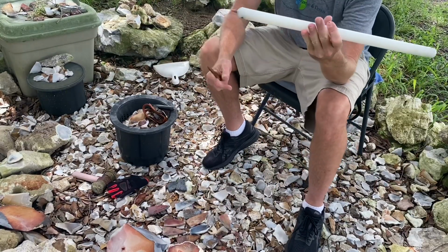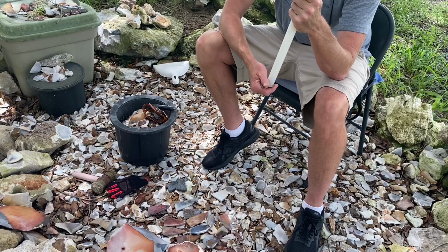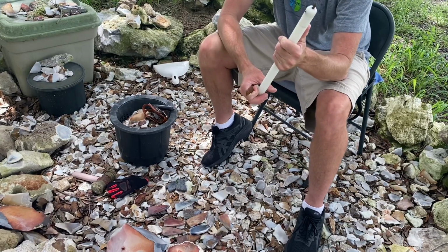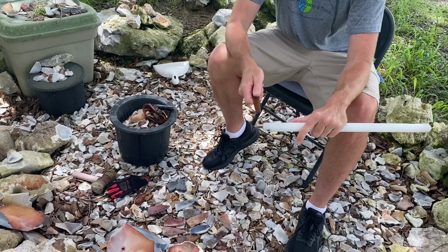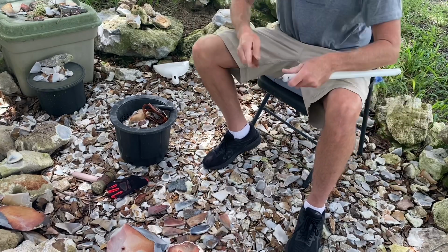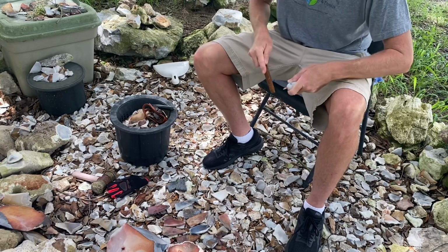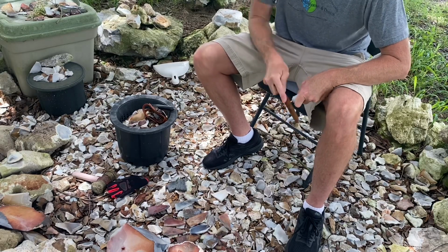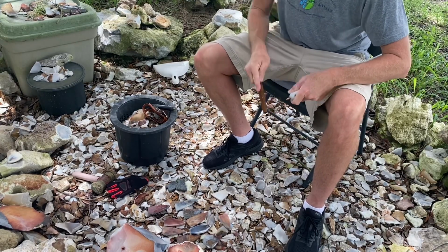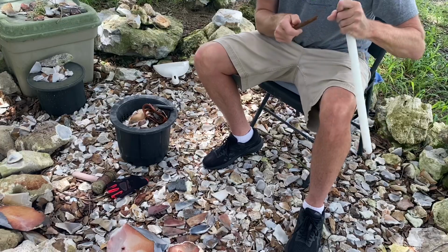Secondly, this is the Ishi stick that I use. It's a 20-inch Ishi with, I could look it up if you need me to, basically a large diameter copper rod in there. So it's not the size you use for indirect percussion, but it's the largest size they put in the Ishi stick. What I've done is I've already hammered this. I put it on a piece of steel and hammer it on all four sides, go around a couple times till I have a taper on there, and then I take the file and do all four sides again. We're not getting a point like a nail, but we are getting a point on it, where you can take a small piece of that preform off. You need this to be a little bit sharp on the end, not like it's going to poke through, but just not rounded off.